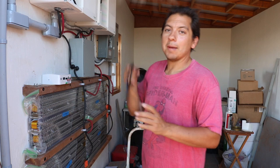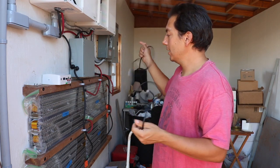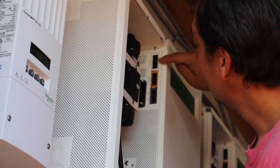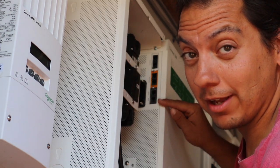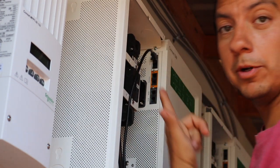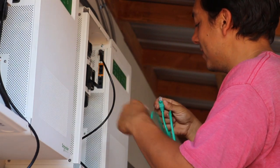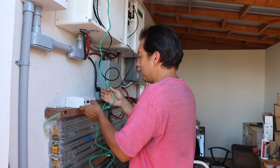First up I got these network cables. I picked one up, one also with the comm box. So I'm gonna hook these up between the Xanbus network ports, hook it up to the comm box and we'll see if that lets it start running. So if you can see, this inverter has the ports here on the side - it's got a couple for the Xanbus, a couple for stacking, REM and BTS. I have no idea what that means, I'll be honest with you. But I'm gonna link these two up with the Xanbus connectors. I'm gonna put one over here and connect it to the other side over there. Now I got both connected. I'm also gonna run one network cable here from the Xanbus connector, then plug this into the comm box and it's working.